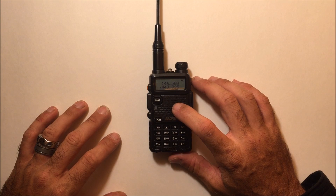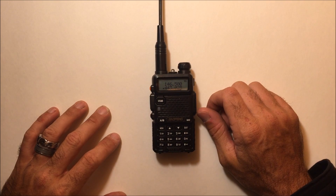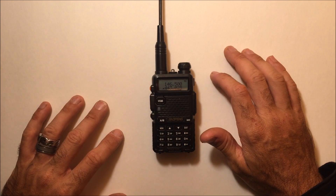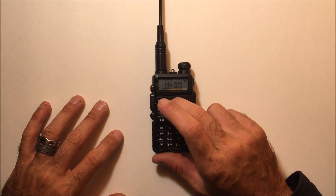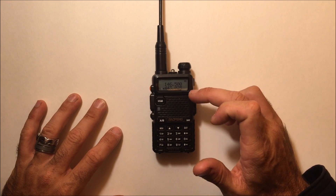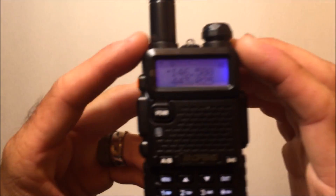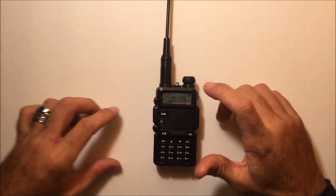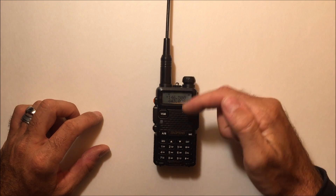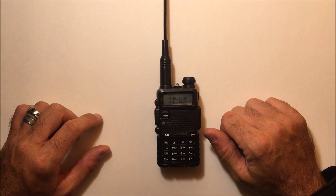Let's go outside and do analog versus digital with Patrick, a friend of mine who lives not too far. We'll see the difference in an area where he's static-y on analog, and then switch to digital and see how that improves communication at that range. Also — if I go on VFOB I'm on analog, and VFOA shows a 'D' — I'm on digital. That means I could have digital on one VFO and analog on another for dual receive, without having to switch back and forth.